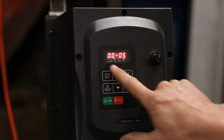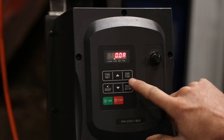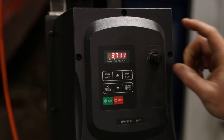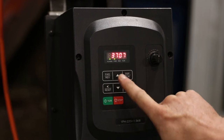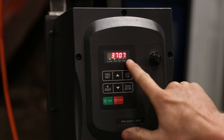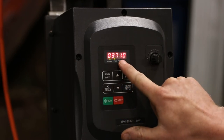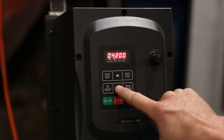It should say 'end' — if it doesn't, it hasn't worked and you have to go through it again. Hit the function button two more times and it takes us back to speed. Now you'll see the potentiometer does nothing — it's completely disconnected from its circuit. The speed is now adjusted using the up and down arrows. While it's flashing it moves the last digit, but we can use the left arrow key to select a higher number, which lets us change the speed a lot faster since changing one unit at a time would take very long.